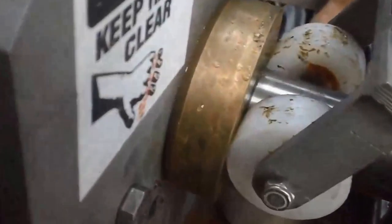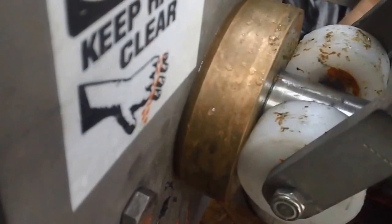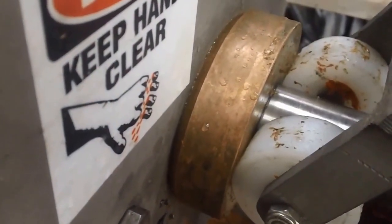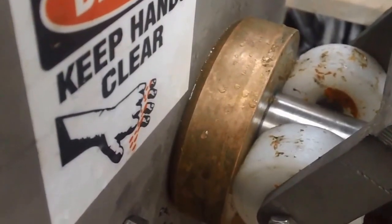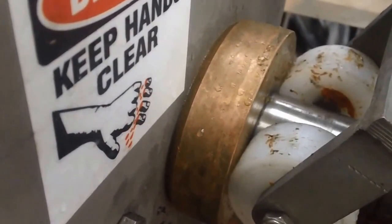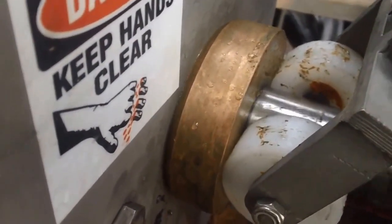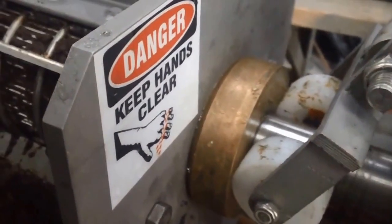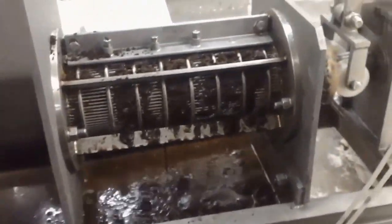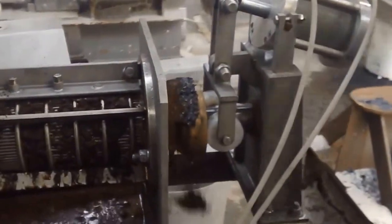I think we're going to start seeing material come out past the cone pretty soon. There's a little film of water you can see, and usually you'll see that leakage before the plug of solids forms, and then that leakage will go away. Okay, we do have some cake coming out of the end.